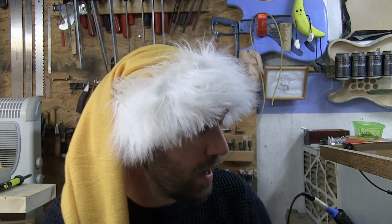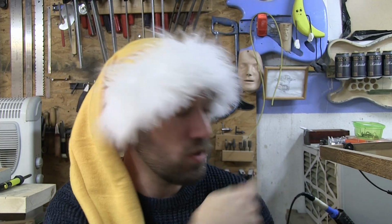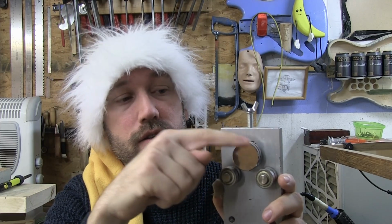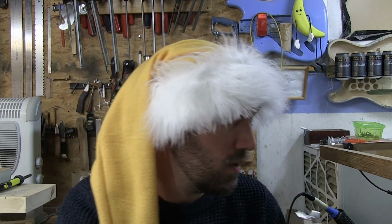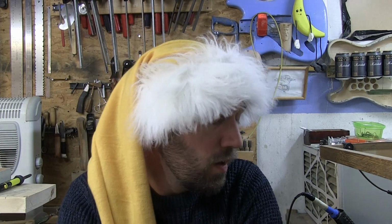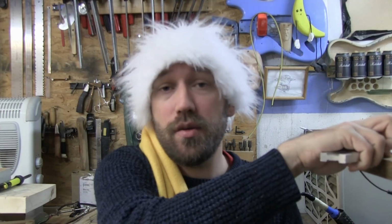And then if you do this to all radius blocks that you have, whenever you're moving, you just have to move this wheel up here to that correct line, and you will be there. And you can just keep re-radiusing it over and over, and you've sort of modified your tool to always know exactly where it is. And it's not hard to do, but you have to make sure you're accurate. But the good thing is you only have to do it once.